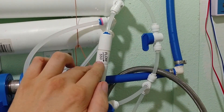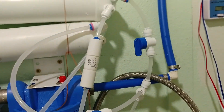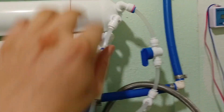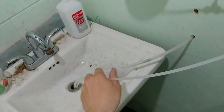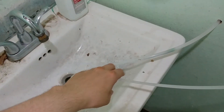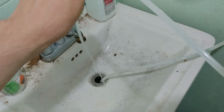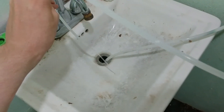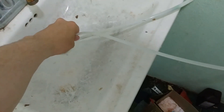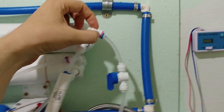The secondary membrane is going to go bad about 5% faster than the bottom one, but the membranes themselves are $20, and that's significantly cheaper than the water. You can see the secondary output — I've got this 550-rated flow reducer, which is the milliliters per minute of reduction you get. That means every day this system is taking 210 gallons and throwing it down the drain. You can plumb this into the drain itself — they make adapters for about $5.